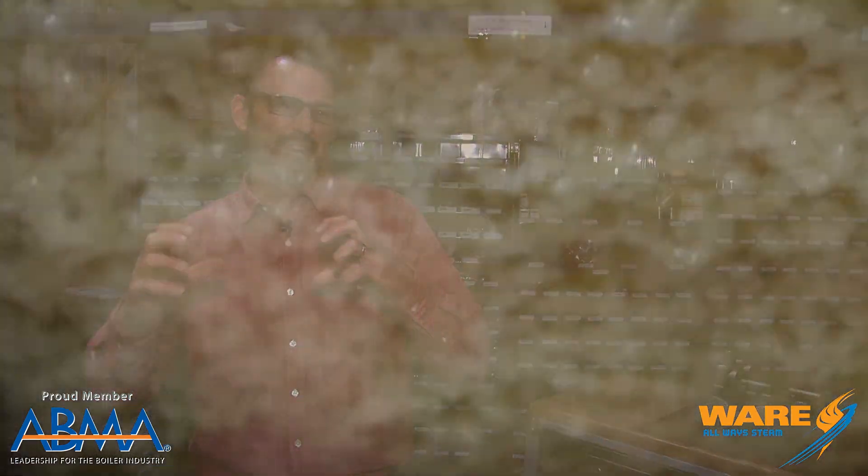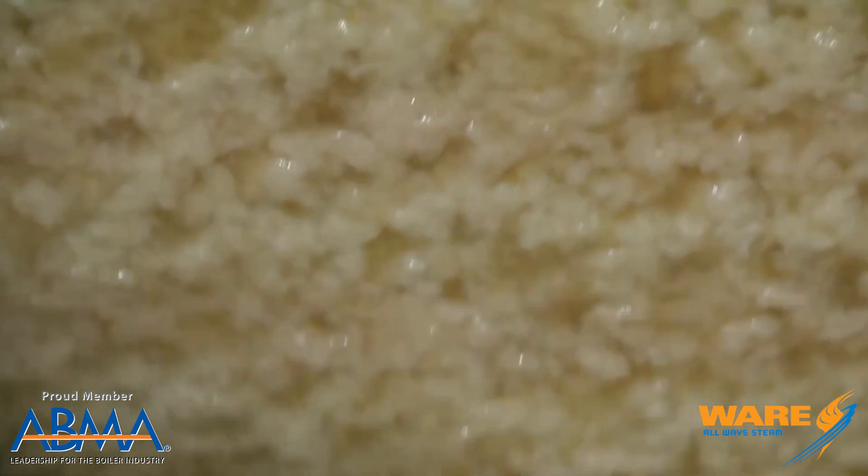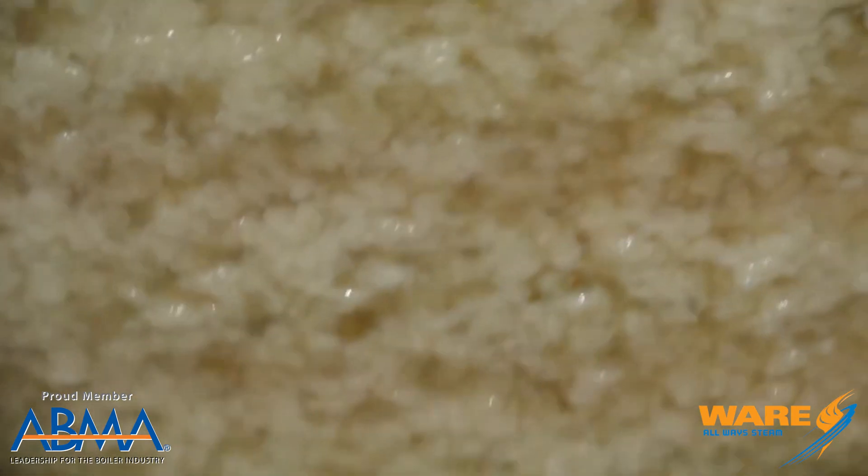So you're left with really two things. You're left with this pulpy, almost cooked oatmeal kind of substance, which is wood pulp, and then a dark substance which is the separated lignin and water — it's called black liquor. From there, the wood pulp heads on to the next step of the process towards making paper.